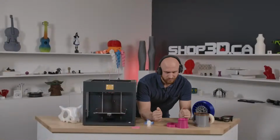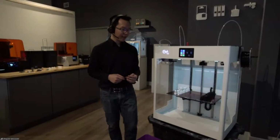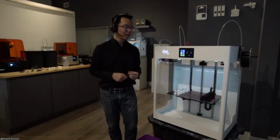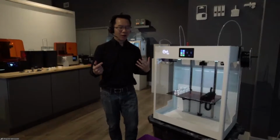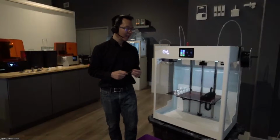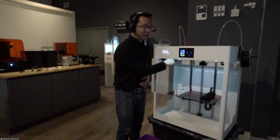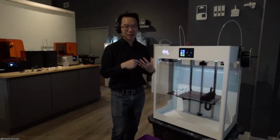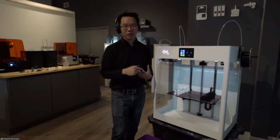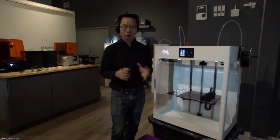Yeah, and I wanted to mention, in terms of print quality, the lack of stringing. Usually with dual extrusion, if the other nozzle is not being used, it strings a little bit. So that's something I want to highlight. There are wipers here that I forgot to mention, silicone wipers on each side. When the head parks to the side, it wipes the nozzle before going to the print, and I think that helps in reducing some of the stringing that can happen on dual extrusion prints.